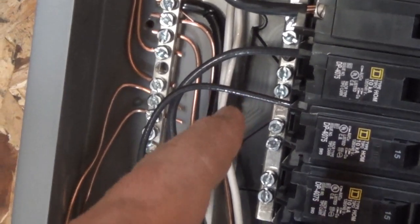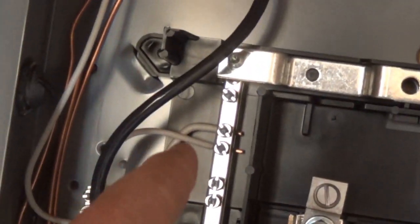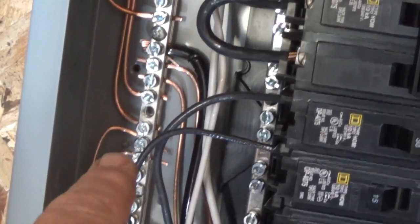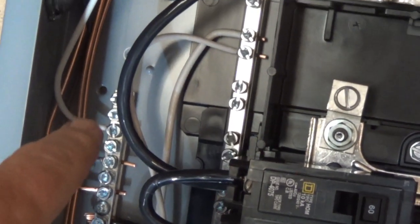As you can see, on this ground every one of these breakers goes into a black wire, which has in addition to it a neutral wire which is white, but also copper. So every one of these will have a copper inside it, and everyone has to be connected to this bus bar — this is called the grounding bus bar.